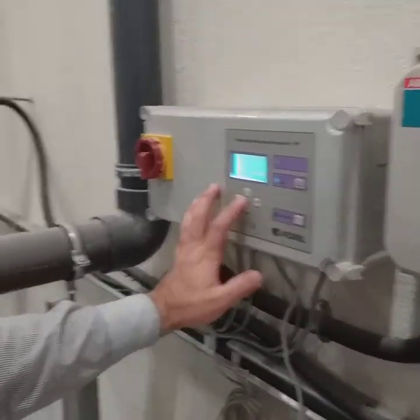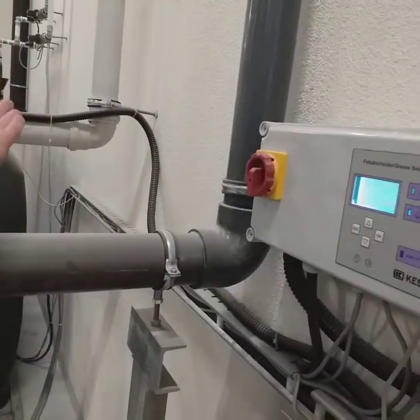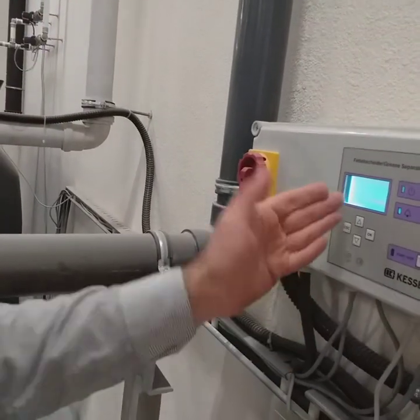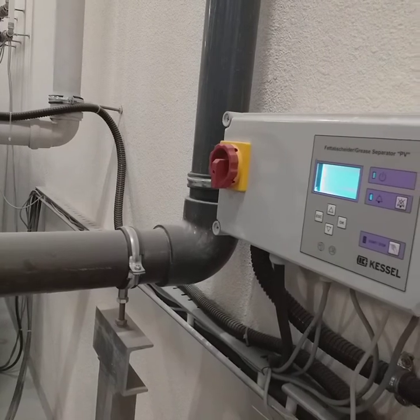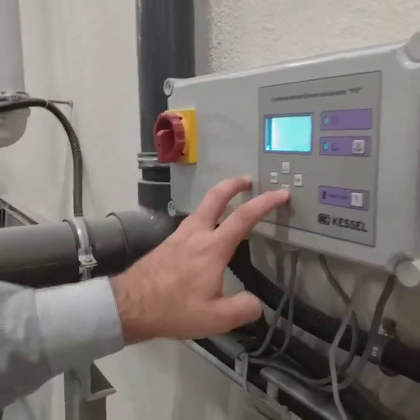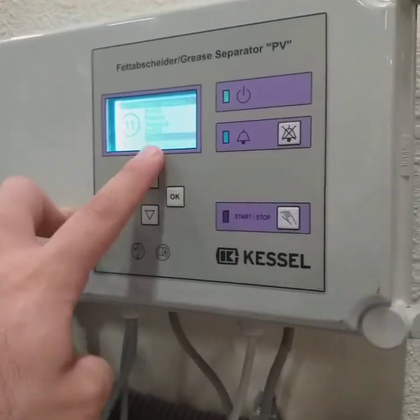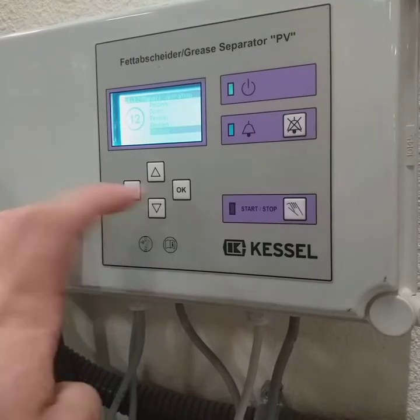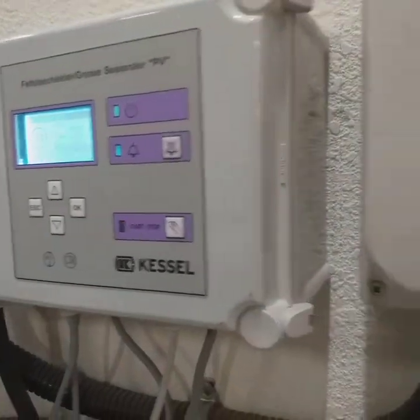Now this is 5, then you will go to 6, disposing, and then number 7, you refill again with hot water, and then you go to number 8, you rinse. It means that you are at the rinsing stage, the final stage of washing clothes. Same case here. Now disposing, and then you refill again with hot water, and then you rinse, and then you dispose, and finally we refill with cold water. Why cold water refill?